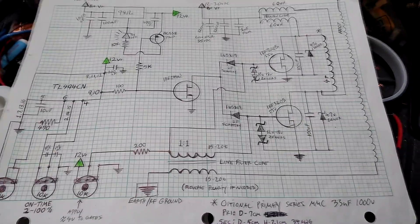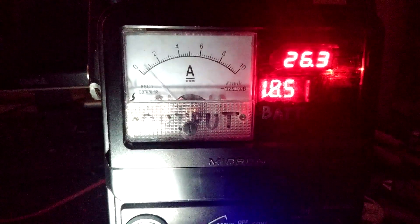I'm trying to replicate the circuit that I had going really good on a bigger coil. I learned that tuning this thing by this big monitor on the table was a bad idea because it doesn't work the same over there with all this stuff around. Anyway, I'm going to cut it on — right now it's at 26 volts and I'm not really going to pull a whole lot over an amp or so, but as I increase the voltage you can see the dramatic jump.